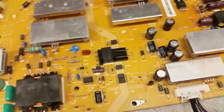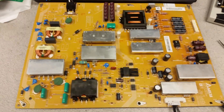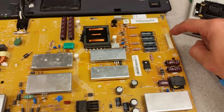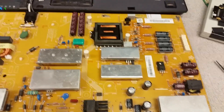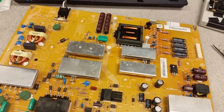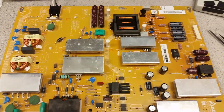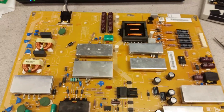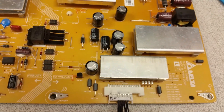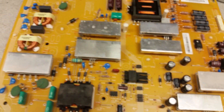This is the control that the main board exercises, and I'm doing it manually here. So far this board is testing fine. The two things we did not test: number one, we did not test any of the LED outputs. That is a little bit more difficult for these boards — it can be tested outside, but one needs to have the proper load for all four channels, or the easiest way is just to have a live TV and control those pins to make the lights go on.